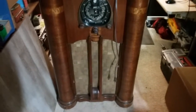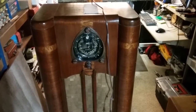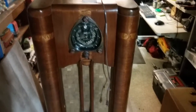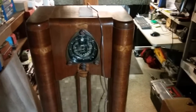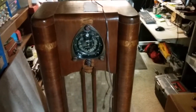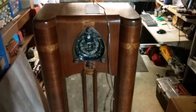I apologize for having the dates messed up. I didn't realize at the time that the cans were changed - they look original. But after finding out about the transformer being changed, I realized that explains the IF cans. It most likely fried the original cans when the old transformer shorted out. So they put in a new transformer and new IF cans - that's where the discrepancy comes from.